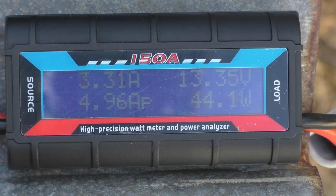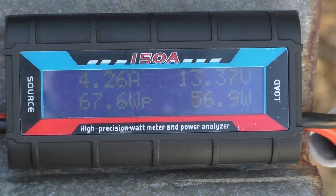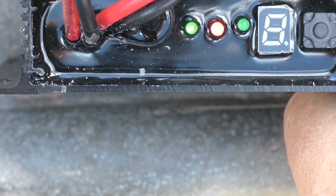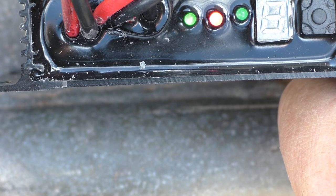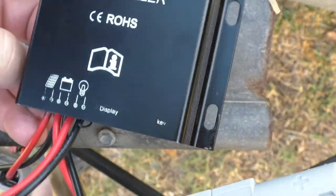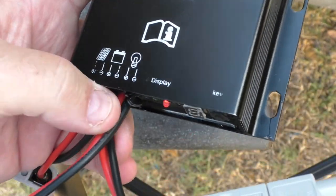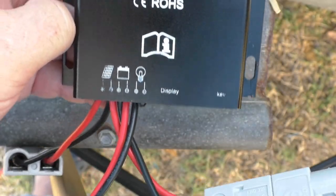It's really difficult to believe these things are MPPTs — I certainly don't believe this one is. You can also see where the wires go in — it's actually not sealed up as well as it should be. It pulls away from the sealing material, so it's not fully weatherproof. It is sealed on the top and sides, so as long as you mount it upright there wouldn't be too much moisture ingress immediately, but eventually it would get in there and cause trouble.